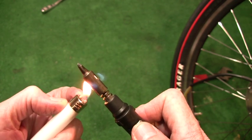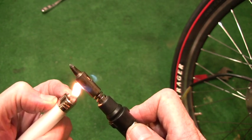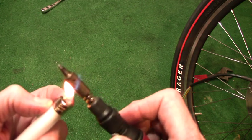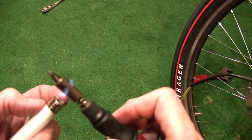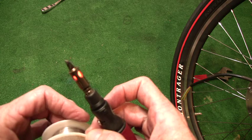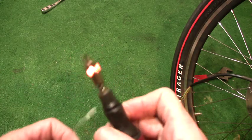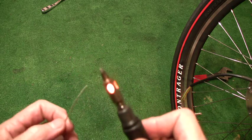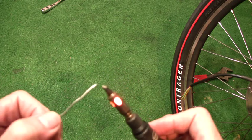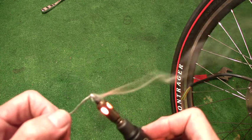There's a catalytic element inside. We have to let these blue flames blow out — after a while they will. When the internal element glows orange, you're about ready to start soldering. Have your rosin paste soldering flux ready. There you can see it glowing orange. Let's turn it up all the way. It takes a minute for the tip to get hot — it's soaking that solid copper tip. You want to be ready to melt solder on it; this is flux solder.